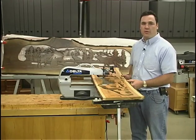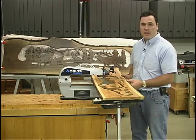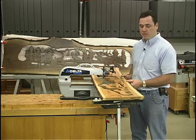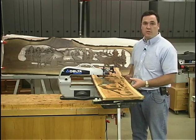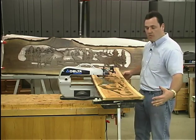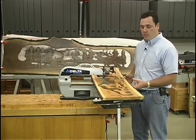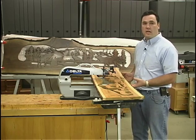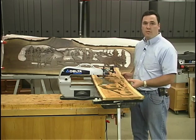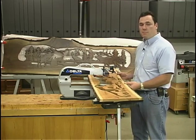The next section I want to address is how to maneuver and move the larger slabs. What I do — especially for that elk scene behind me — is use outfeed rollers extended out approximately two feet or greater, depending on the length of the piece. You want to raise the actual cutting up off the scroll saw so it gives you a little bit more easy movement from side to side, essentially moving the piece from side to side and back and forth.